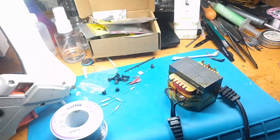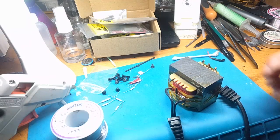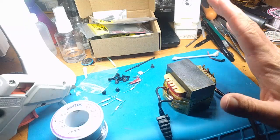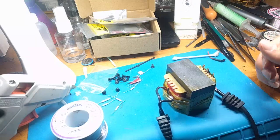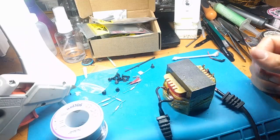Yeah, I would have really opted for 2 fuses in there, especially given what this thing costs. To not have fuses is kind of silly, very silly. So yeah, not a lot of things I can fault with the design, but that's definitely one of them. So yeah, folks, when you're doing your power supply design, please include fuses, and don't make really wide traces if you don't. And yeah, serviceable parts are always nice, and holy crap, sometimes you can actually save a transformer brick power supply. Go figure. Also, don't buy things that are AC output. If you have to get a mixer, get like the Yamaha MG06 that I got, which uses 12 volts DC. Avoid as much as you can any of these AC output power supplies, because they are just going to drive you crazy if they ever have a problem.